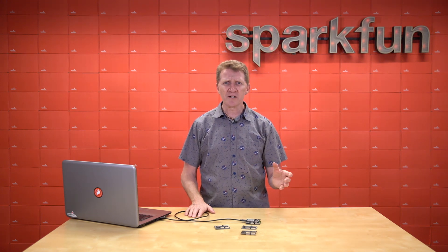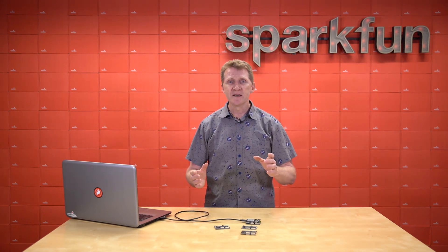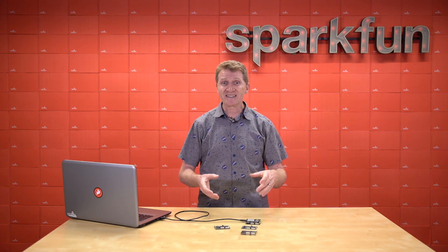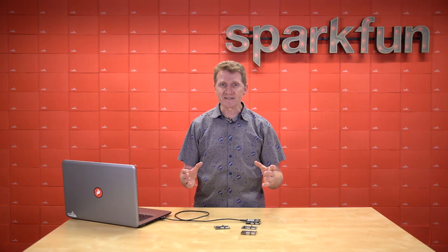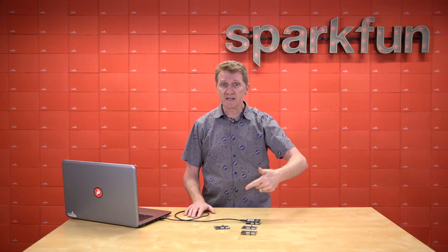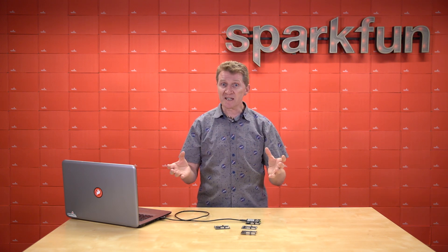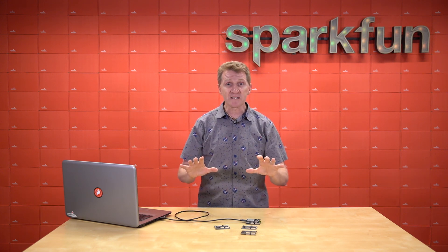Even if you've been programming in Arduino or Python for years, FPGA is a whole new beast — you're working on a whole different level. Say you want to blink an LED. In Arduino, you blink an LED without worrying too much about your processor speed or most significant bits. But with FPGA, that's exactly how you blink an LED. And suppose you want to do multiple processes — say two dozen processes at once. By the nature of the void loop in Arduino, those happen in order, and the more processes you have, the more delay between each one — and keep adding them, and it starts to become significant. FPGA eliminates that delay because you can make multiple circuits occur at the same time.